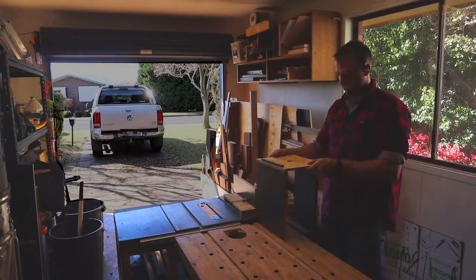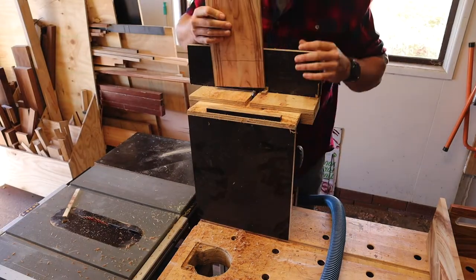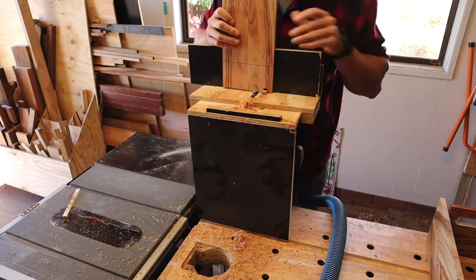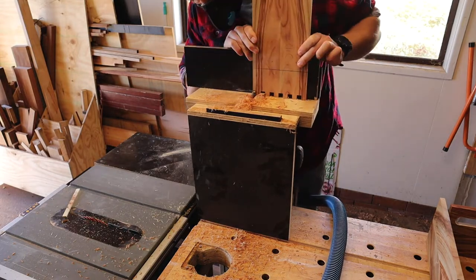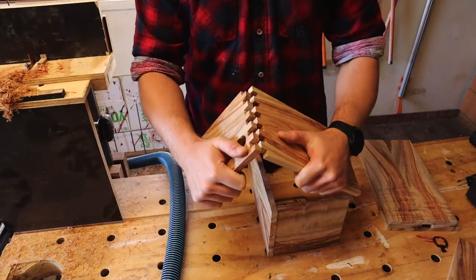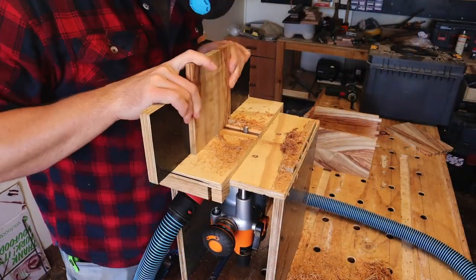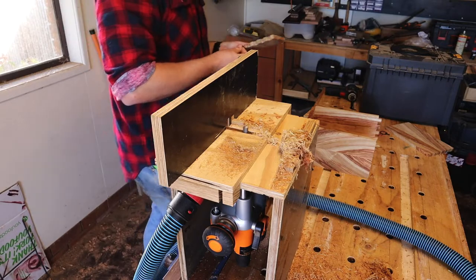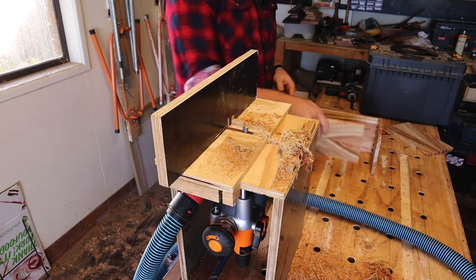As per the thumbnail, I'm going with box joints for this. So I set up my quick router box joint jig that I made from Make Something's video — I'll link to that in the description. It's a great jig and it makes simple tidy box joints. It can be easy to get turned around though, so just make sure everything's labelled. And then take another minute to confuse yourself if necessary, like I did here.